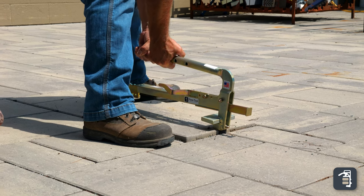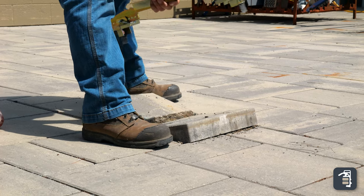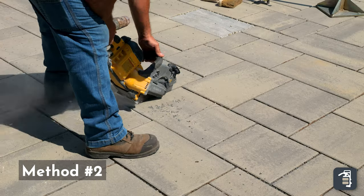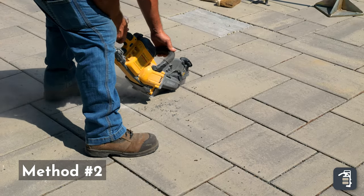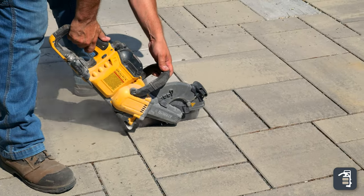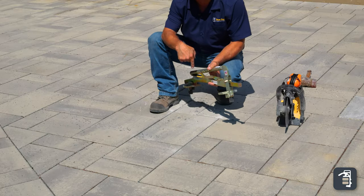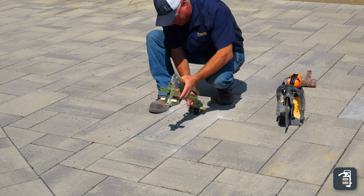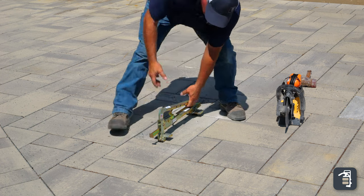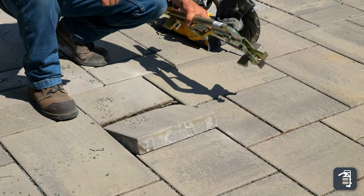So it's not ever a simple task to extract pavers, but with the right tools, you can see how simple it can be. There really is no easy way to extract pavers — it can always be a challenge, but there are some tips and tricks. One of them is using your standard cutoff saw to cut that joint around all your edges, and you'll see just how simple that makes it. So once I've had all my joints cleaned out, it's just again a simple matter of getting the paver popper on here, and I can simply pick up — you can see how simple it is to take out. Much, much easier.